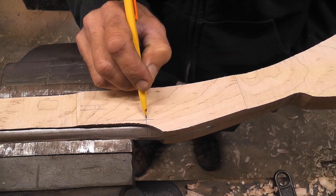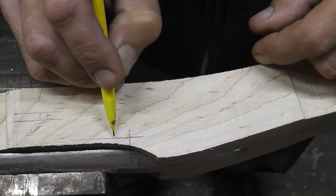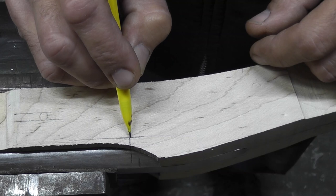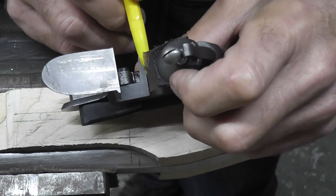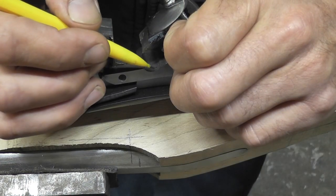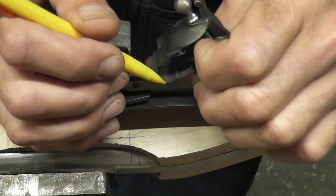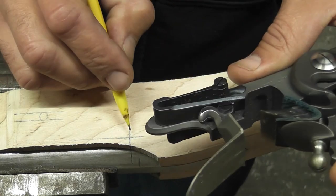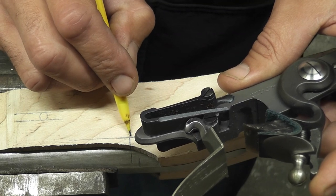This line here is the center of the barrel — that's where our pan will be, actually a little bit below that. You do not want your pan above that line. When the powder ignites in the pan on the lock, it's the actual flash from the powder in the pan that ignites the barrel — not the powder itself going off. So if we install the pan just a little bit lower, we don't want the powder in the pan covering the flash hole or the vent liner. We want it just a little bit below so we'll have good ignition.